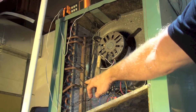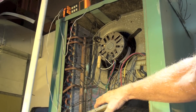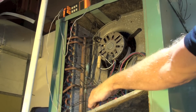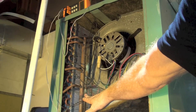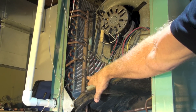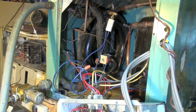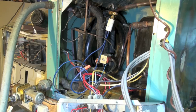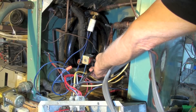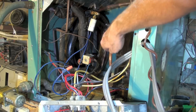The same cap tubes are used for heat as well as cooling. The refrigerant passes through the cap tubes, the pressure is dropped, and the liquid line becomes the start of the evaporator. It passes down here and into the heat exchanger where water is running through - heat is absorbed from the water, cooling the water down. It comes out of the coil right here on this insulated line and goes into the reversing valve.